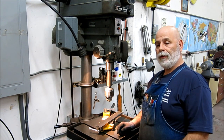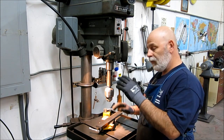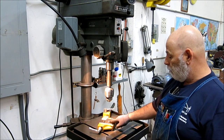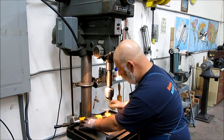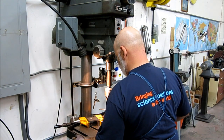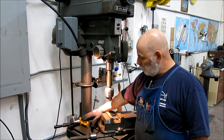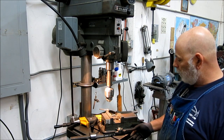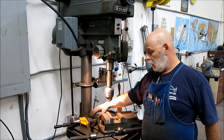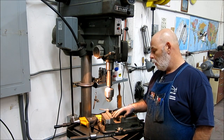But like a lot of good stories, there's a lesson there. People get in trouble on drill presses because they just look so innocent and you think you can just hold onto stuff and go — and that's where you run into trouble. You want to clamp stuff down with a vise, like a float lock like this. And you guys can now immediately see the family resemblance — instead of a small vise like this, I've taken a Kurt vise, put a little slider on the bottom and a bar that locks in the T-slot, much the same way this locks in there. That's where I got the idea — I didn't invent it; I give these guys credit, or Heinrich, they have a similar setup.